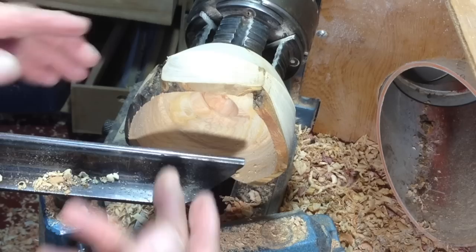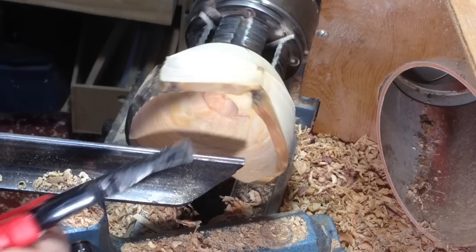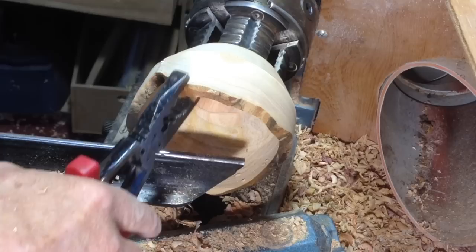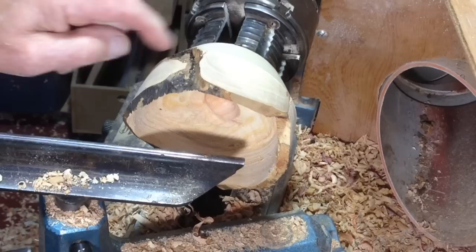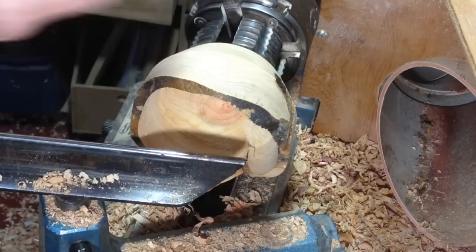So that's solid timber. If I take any of that down from either side I'm going to have that long thin bit, which will probably now come off. With a rim like this which is going to be a little bit battered, I can singe the edge so it'll be a kind of blackened rim — and that means I'll also be able to cope with losing that little bit and make it look as though it was always there. At least that's the idea. So I now need a shoulder on the inside I can put over the jaws.